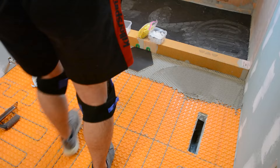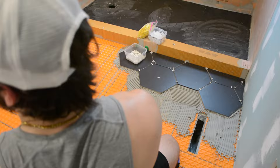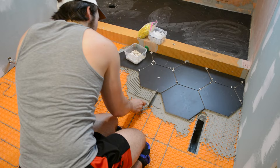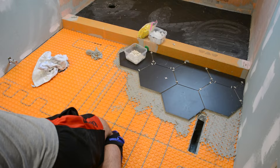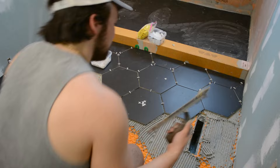Here you want to be a little careful as you don't want to damage the heating cable with your trowel, as it could potentially cut through the cable. I was using my trowel as normal and didn't have any problems, so as long as you're not extremely aggressive I don't foresee it being an issue. Make sure you clean up all the mortar if you stop in a particular area, because you don't want it to build up and harden and cause problems when you go to lay tile later.